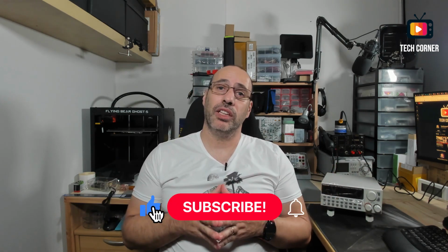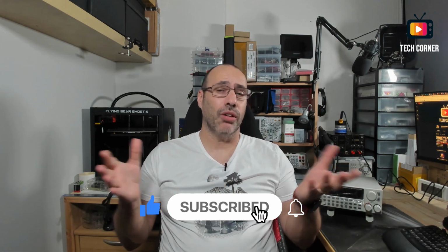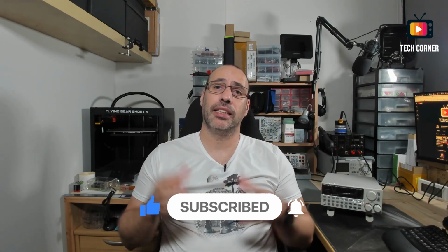And today for my review I have something different. I have here the Korad KEL102, a programmable DC electronic load. This electronic load operates at a maximum of 150 watts, 120 volts and 30 amps, and is the light version of the KEL103, which supports 300 watts instead of the 150 watts of this module.